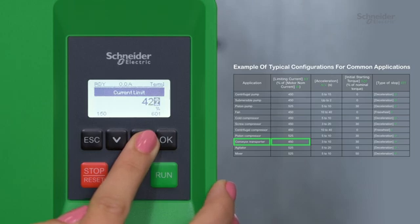You can now start your motor. Refer to run and stop management in the user manual. To power up the power section, push S3. As we are in three-wire control, we apply a run command by pushing S5. The motor starts. We apply a stop command by pushing S4. The motor stops according to type of stop. To remove supply from the power section, push S2.